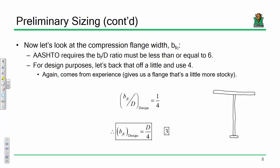It's very possible the worst scenario is during deck casting. If you remember efficiency from reinforced concrete design, when we took the load over the resistance, we call it performance ratios in bridge engineering. It's very possible you have a higher performance ratio when the deck's being poured than when it's actually in service. Okay, you have to assess both, so you have to assess the girder in its non-composite state and its composite state. And to further answer your question, yes, when it's composite, you compute capacity.